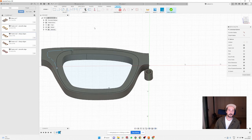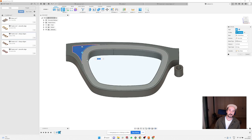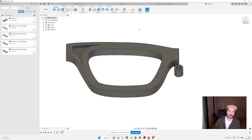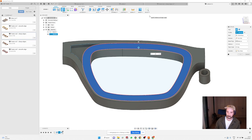And now what I can do is just go back to solid and press on this surface, and I tell it I want to recess 2 millimeter. And sometimes if you don't have this perfectly connected, it's not going to extrude it. So you can go back to your sketch, open it just to see it here, and you might need to do it again